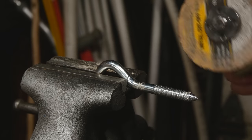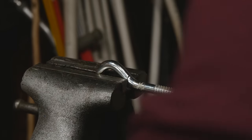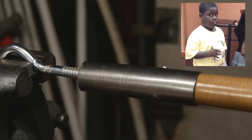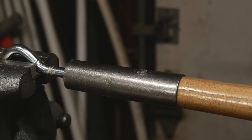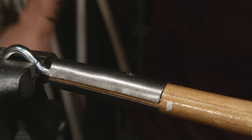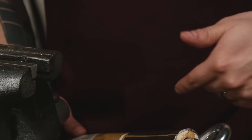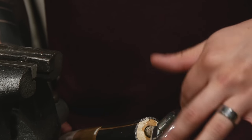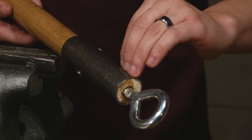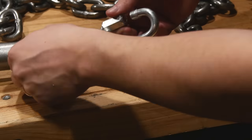To make sure this doesn't unscrew from the end of the handle, first cut a line into the threads, and then use epoxy as a lubricant to screw the bolts in. The way cutting the line helps: if you screwed it in without cutting the line, once the epoxy dried you could just unscrew it out. But when you cut a line into the threads, the epoxy fills up that line so it can't turn side to side anymore - aka unscrew. It's locked in there for good.